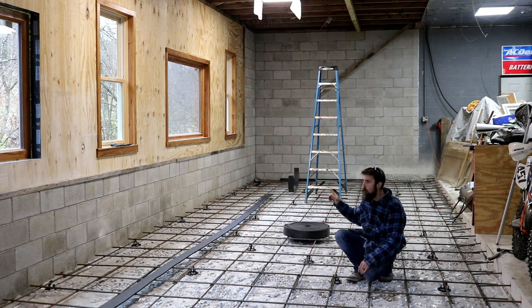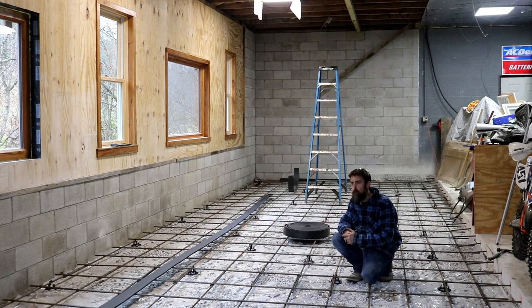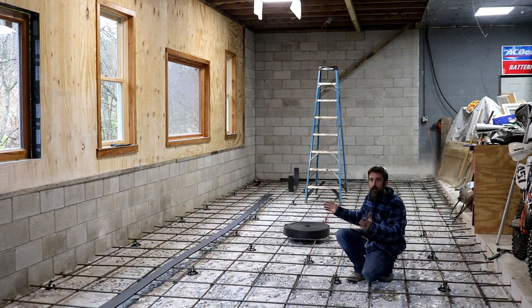It's 47 feet long. So that's going to expand, what is that, 47 and 12 inches, that's 564 inches from front to back. So this will expand per 100 degrees Fahrenheit in length, slightly over a half of an inch, right? 5 eighths of an inch is 0.625. So slightly over half an inch, let's just say that. We'll have expansion joint material in the back and in the front. So we'll have an inch of expansion capability front to back, which is more than enough.